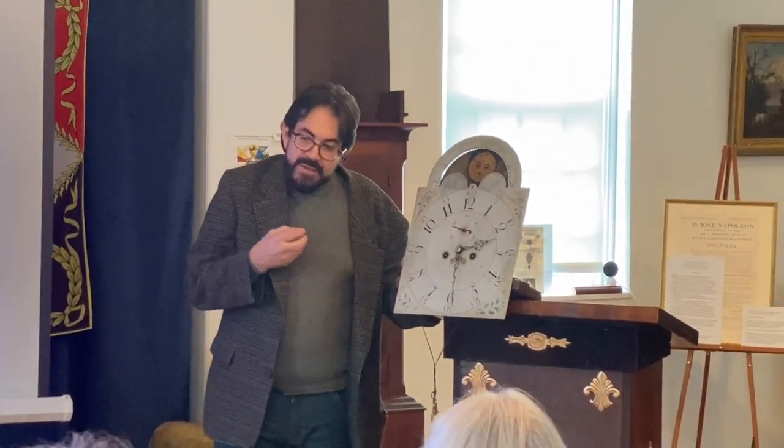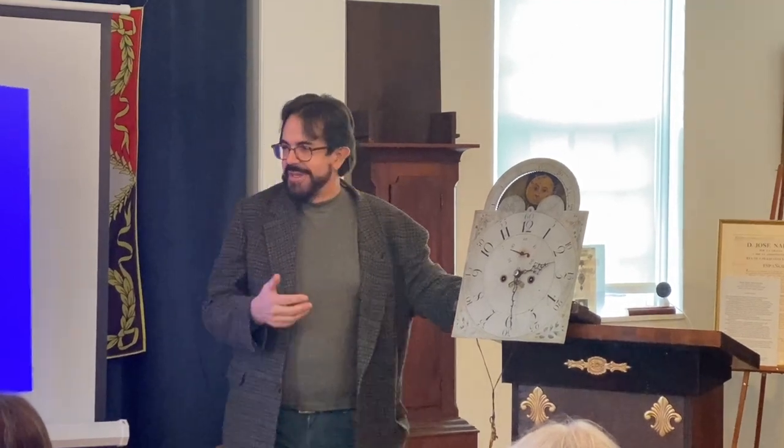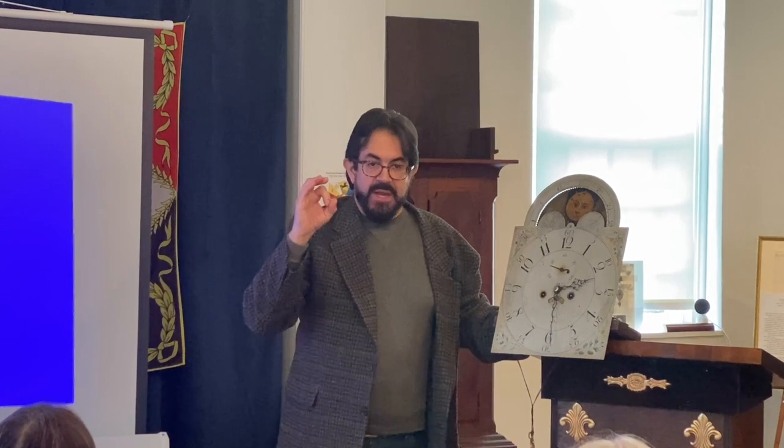If you let it dry and it's running dry, this clock may continue to run with no oil. The problem is, people say, oh, but it's been running for 18 years, I haven't serviced it. Oh, you idiot. You know what you're doing? You're taking a round hole with a round axle with a millimeter of play, and you're steel to brass. So that hole becomes ovoid. He's proud to think that he's saving money by not having his clock serviced. So it becomes an ovoid hole.